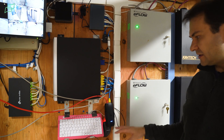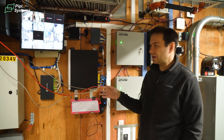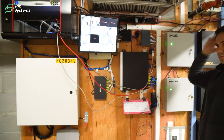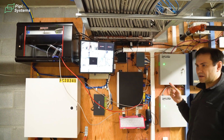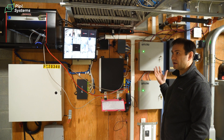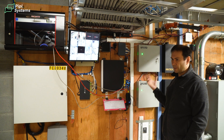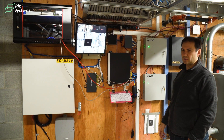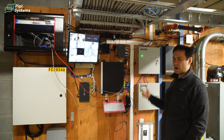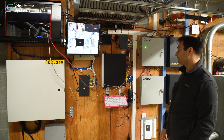Here it's not fully finished as everything is in demo production right now. After our installation of the Ubiquiti intercom, we bypassed the connection to the intercom panel. Please keep in mind that the intercom panel must have only one Cat6 cable — nothing else. From an installer's perspective, this is very comfortable: all Ubiquiti access control wiring requires only a Cat6 cable — no separate reader power, sensors, or extra cables.